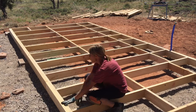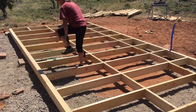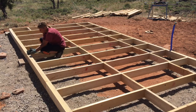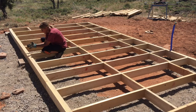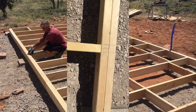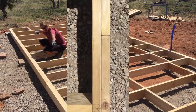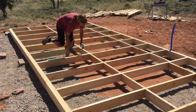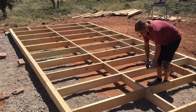We did double up our outside rails because this is a 20-foot length. And so over here, we have 2 10-footers that are broken. You can buy 20-foot 2x4s, but they're very expensive and they're often crooked. So we chose to go with 2 10s. But that meant we supported this break in our 10s by putting a full-length 10 on the outside and then 2 5s. And now this whole rail is super stiff, because if we ever moved this building, which we're not planning on, but we're building it like we might, we would want that to be super stiff.